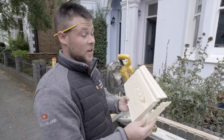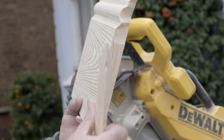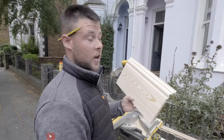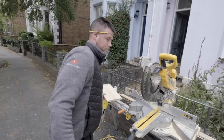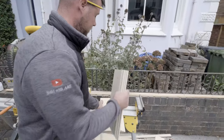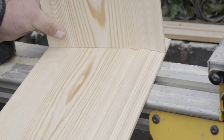As you can see, we've taken a lot more out the back than we have the front, and that's so when our skirting goes up to it, it'll sit up nice and flush. Okay, so we're going to try it now and see how we got on — there we go, perfect.